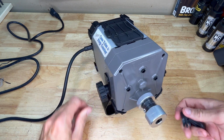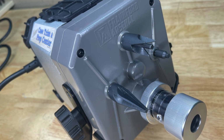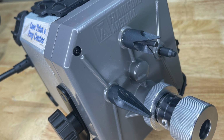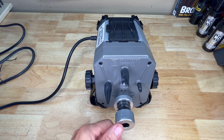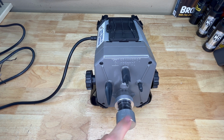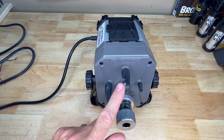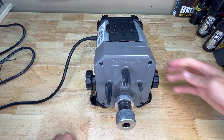All right, so just kind of thinking about how I would do this. I would probably trim, then clean up my primer pockets. And one thing I noticed already that would be nice. So it looks like the idea would be you would trim your case, deburr the inside, deburr the outside, and clean your primer pocket. Of course, this is after resizing.